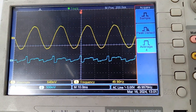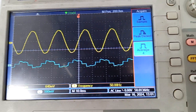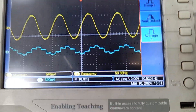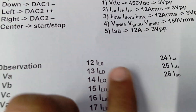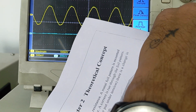Then ILA, ILB, ILC — ILA will be in phase with VA. Now we will see ILB and ILC. Then IL_alpha, which is similar to ILA, and IL_beta. Now this is the IL_zero component — signal 12 — and you can see it is almost zero. We can increase the time-per-division to see this waveform better.